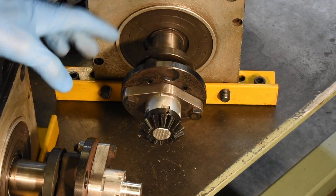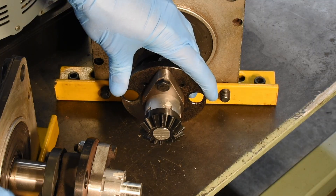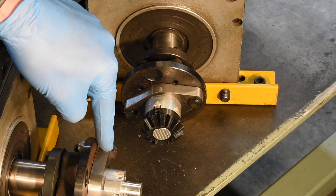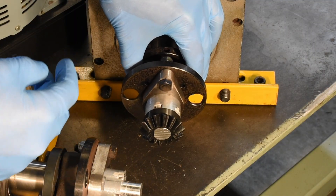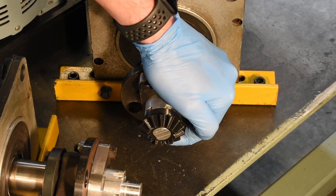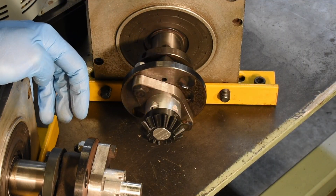An issue with this system is there's no way to compensate at zero speed, because the system requires knowing how fast the motor is going to know which direction to apply the counter-torque to counter the friction. So if it's stationary, it doesn't know if you're trying to push it one way or the other. You'll probably see it sort of wave back and forth, because even though it's almost completely stopped, it's still moving a tiny bit and it can't quite pick a direction. That's why I'm running all the tests above zero speed — even if it's just 10 RPM — which eliminates the static friction issue and basically fixes a lot of stuff.